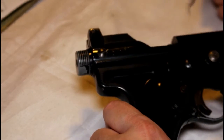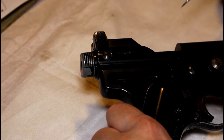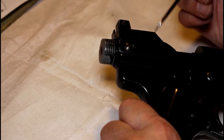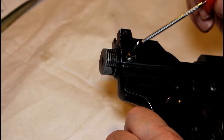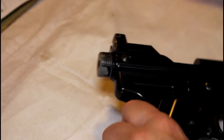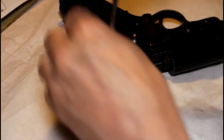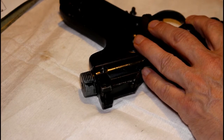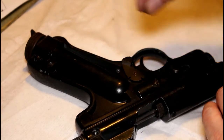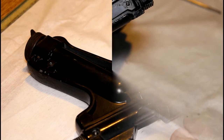On my instruction list I'm jumping from number one to number eight, where it says old marks have a bolt guide screw that is removed next. This is part 1064 on our diagram - it's this screw here, with one on the other side as well. You may not have this screw on your particular gun; this is the variant that does. We'll take this screw out, flip the gun over, and unscrew the other screw. With those both out, I'm going to place these two screws on my board at number eight.